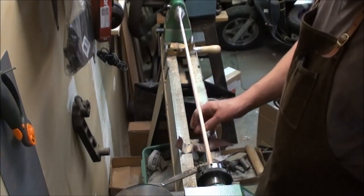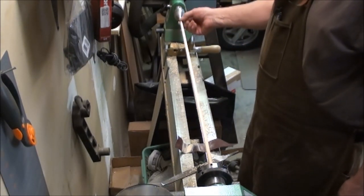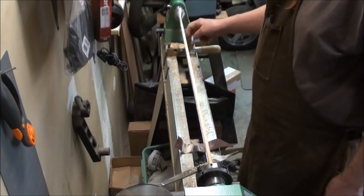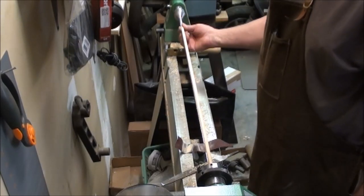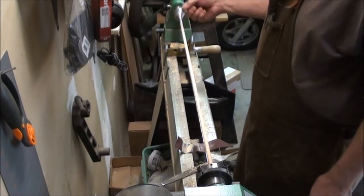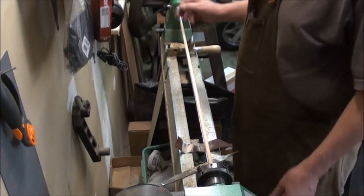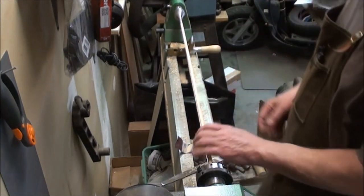Close to finish, and I actually used a sacrificial tip here because you are going to hit it with the plane and with the sanding paper, and it's going to make a deeper mark in it than what you want in the finish. So this one is just put on temporarily, pull it off, put the final one on, and pin it. So let's go ahead back to the bench now, and I'll show you how we can finish shaping this out.